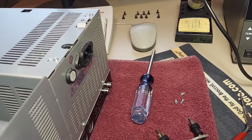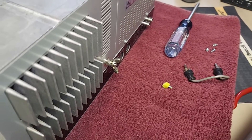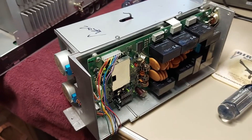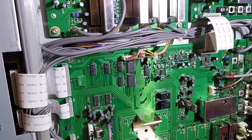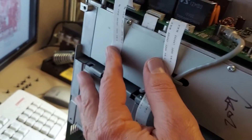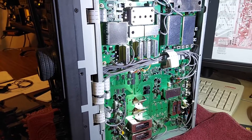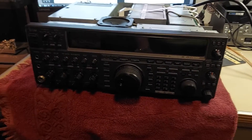That's really easy to work on. We'll put this sucker in - it's held in by four screws. One had a little piece of tape on it to hold it to the end of the screwdriver because it goes all the way down in there and it's hard to get to with a short screwdriver. All installed and ready to go - top cover on. I'll put some filament tape down on these so they're held in place, put the bottom cover on, power it up, and transmit into a dummy load.